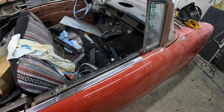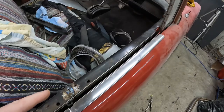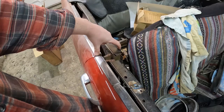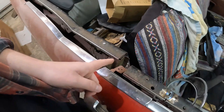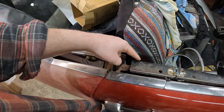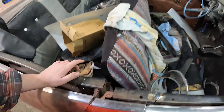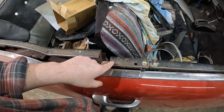Here is where things are going to get goofy. I caused this problem, but we're going to live with it. This is the original door post from a four-door hardtop, which is obviously quite a bit wider when I put it on, so we've got this big gap. There's no way we're going to do anything with it, but I don't want to have just some goofy thing. So what I'm going to try and do is have this molding maybe even start there, kind of curve out and be flat there and up and in. So it'll have an oblong shape, but it's going to be like that on both sides. If we can make them both look goofy, they'll match. I'm going to get some steel out of the quarter and we'll see if we can get it going.